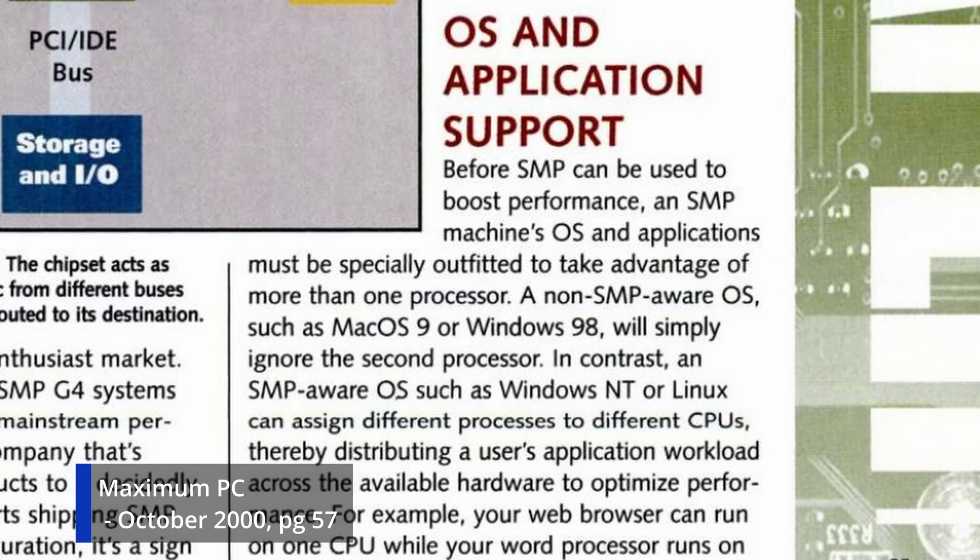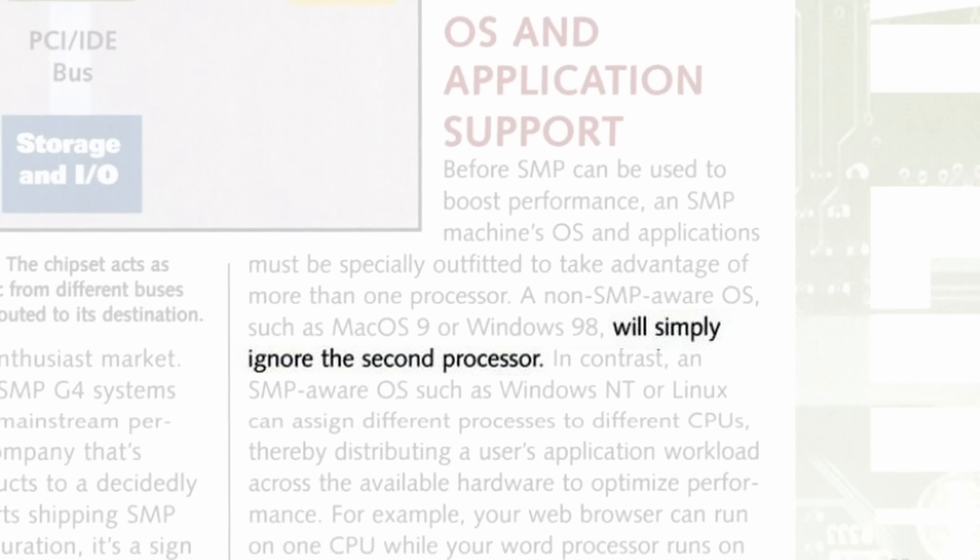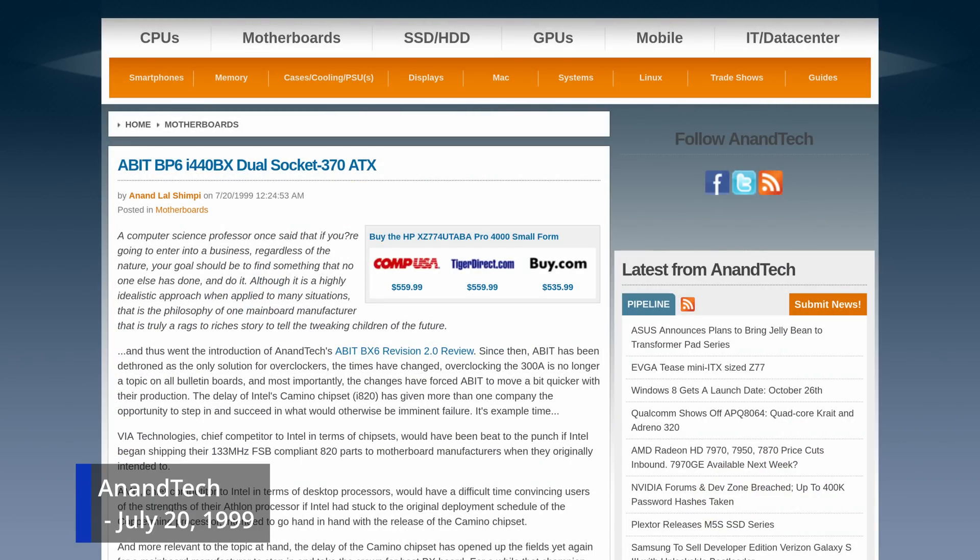The BP-6 from A-Bit is an OEM hack to make Celerons work in SMP, which didn't have SMP locked out. Later boards were able to get Pentium 3s working like this, which was a little bit more complicated, but the BP-6 was the first board to bring SMP to hobbyists. There weren't many operating system options to support this at the time, and Windows 2000 was one of the main ways to support both CPUs in this board due to using the NT kernel. It can be used with DOS-based OSes like Windows 98, but will only use a single CPU. Still though, this revolutionary feature cemented this board's legendary status.